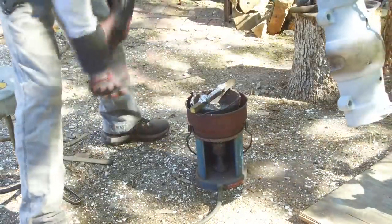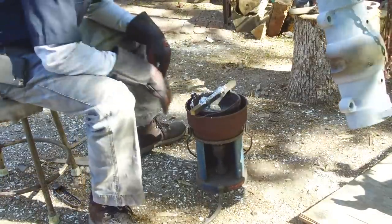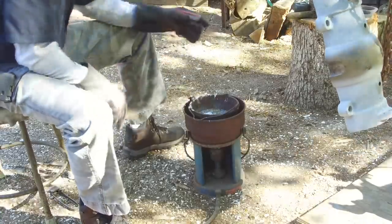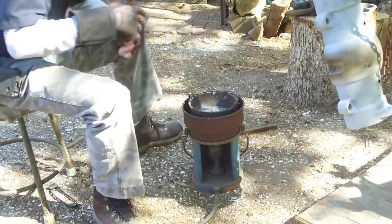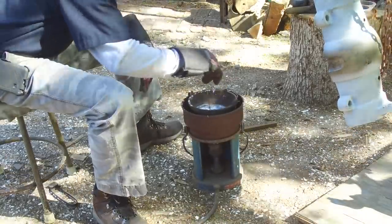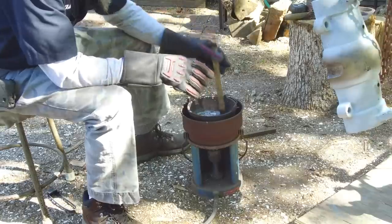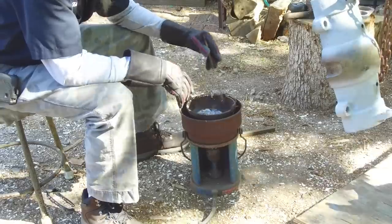We moved the camera around a little bit — out here it's pretty hard to deal with the sunlight on the lens. We're going to go ahead and just break off the little spillage that was on the bronze key here. Babbitt doesn't stick to everything. We're going to clear the dross off the top and rub the bottom a little bit.